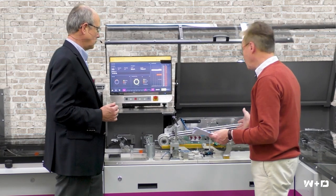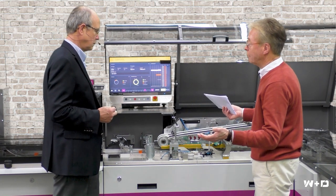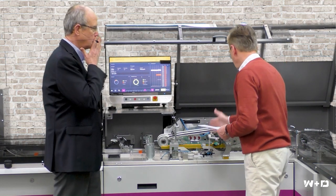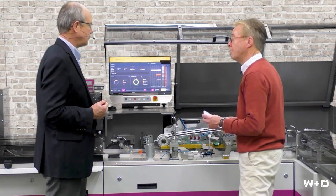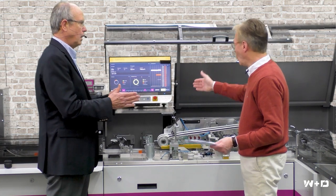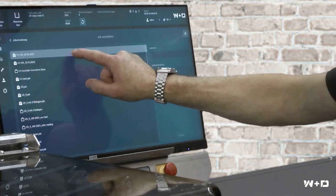Control of the smallest sizes and lowest envelope depths is granted by our new envelope stopper and exit belt arrangement. The exit belt follows the envelope stopper all the way down, securing that even a short envelope leaves the insertion point with the necessary control. Because the envelope stopper is now brought into position by a linear drive, we also have a limited auto-set feature on this machine, together with other servo-driven features such as the offset of the feeder and the timing of the camera on the feeder.